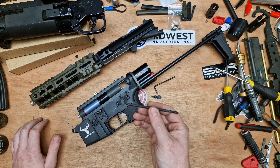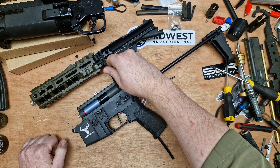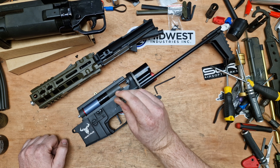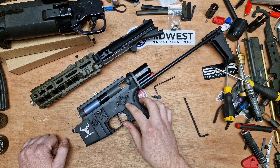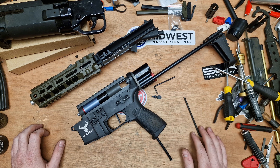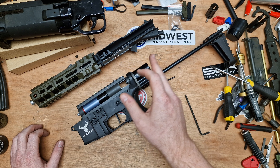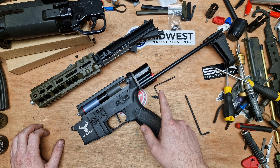What I'll probably do is modify this Allen key so it can be slotted in at the back for quick turning of the stock, and then shorten this Allen key on one end so you can get the torque on it — at the moment it doesn't quite fit in. Then you can torque the stock down and make sure it's tight. Everything else is pretty much as we left it; barrel and all those components are ready. As soon as I've modified this and routed the airline through into the back of the stock, I'll check it's functioning.